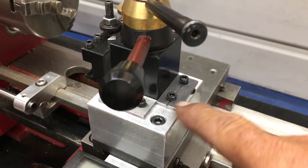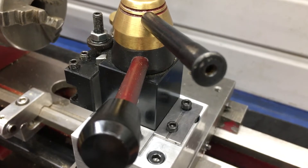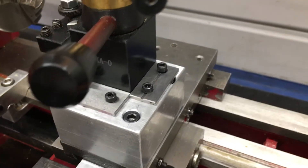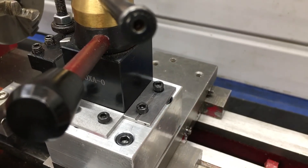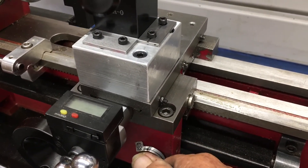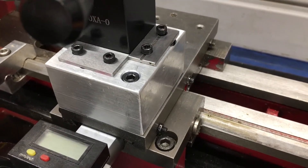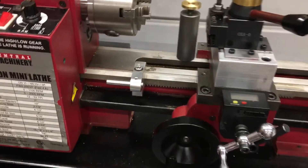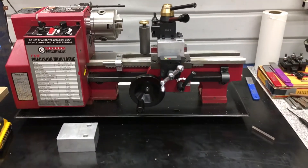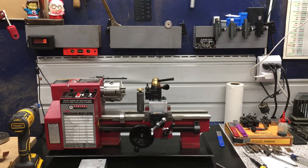One other option with this setup is to remove these two plates, and that way I can easily manipulate my tool post if I need to — and that's probably what I will end up with once I start operating this. I need to reinstall my carriage lock. I've been using the half nut to lock my carriage, but I've got a rather handsome carriage lock so I might as well use it. I'll get on my computer, prepare that piece, and assemble and share that with you.